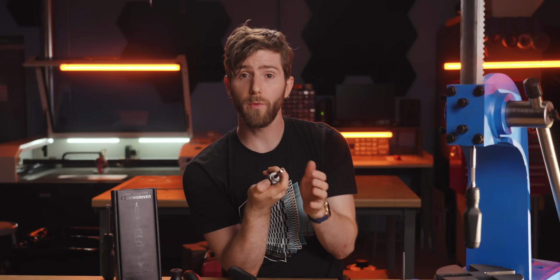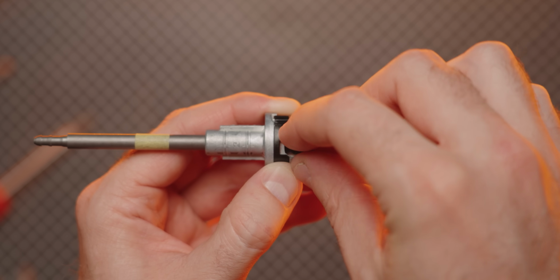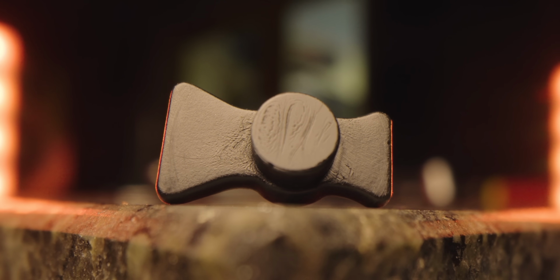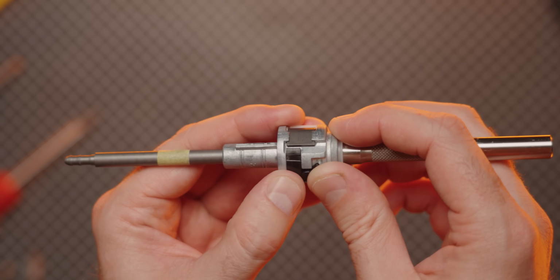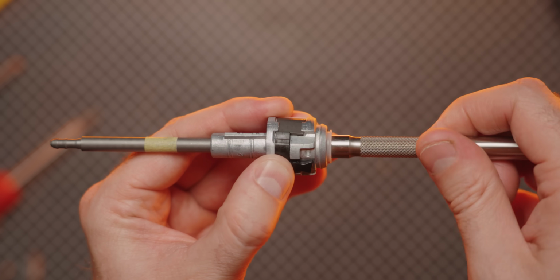To move the pawls out of the way, there are 2 pieces of Delrin that interact with the selector ring. And it turns out that this guy right here was made 5/1000th of an inch out of spec. 5/1000th of an inch! That's like the width of 2 hairs. But because it's a lever, that error was multiplied across the mechanisms, leading to our jamming issues.